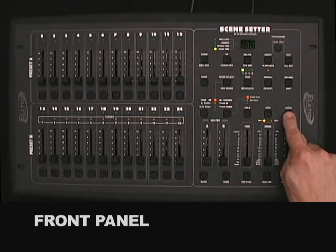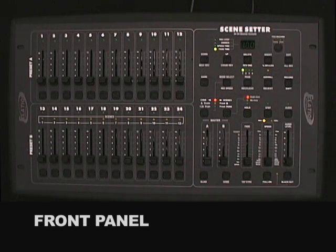The audio button. The audio button activates the internal microphone for sound active chase playback. Master Fader A. This fader controls overall output for all channels. Master Fader B. This fader controls the output of all selected scenes and chases.